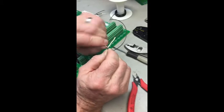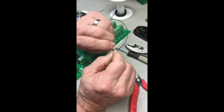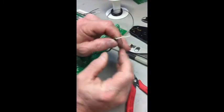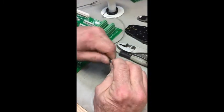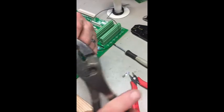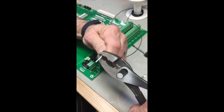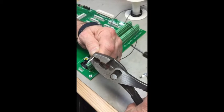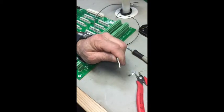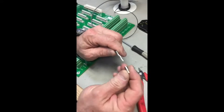Twist it as tightly as you can because we want to reduce its overall diameter. Fold it back — you'll see it has a little hump in it — and simply take a pair of pliers and just crunch the bend down, not using much force, so it makes putting the ferrule on easier.